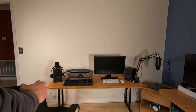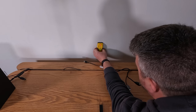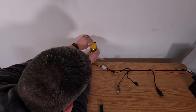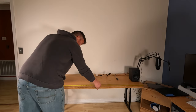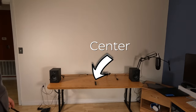Next, we need a layout for where to put the wall mount. To get the layout, first we need to clean up a bit, then find our stud. Use a stud finder to find the edge of each side of the stud — we want the bolt to be dead center in the stud so that we get a good hold. The location of the studs will dictate where the mount can be placed. I also measured the center of the wall and the center of the desk, and it just so happened to land right on a stud.